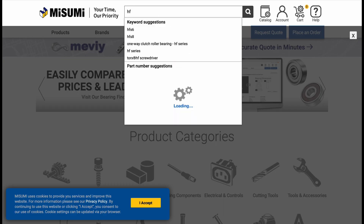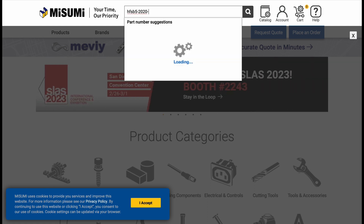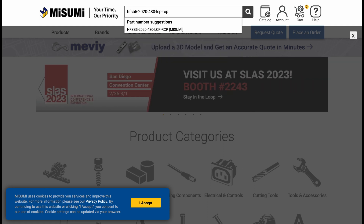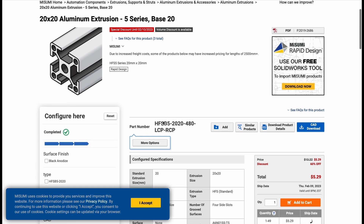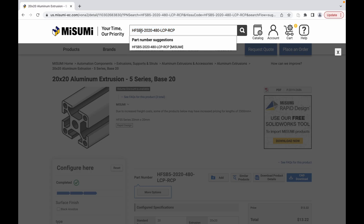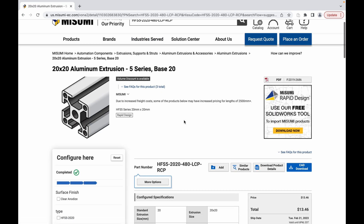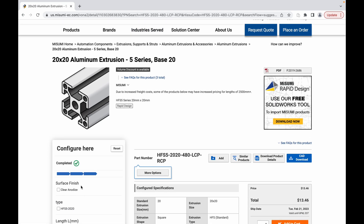The printer frame comprises 2020 aluminum extrusions. On the recommended Misumi website, you type in the exact part number from the BOM, and it brings up the exact pieces you need with the customizations needed, such as length, drilled holes, etc. If you prefer the bare aluminum color, just remove the letter B from the part number. A lot of these buying tips are in the notes column of the sourcing guide. If you want a custom color, you need to buy a pre-packaged frame kit elsewhere.